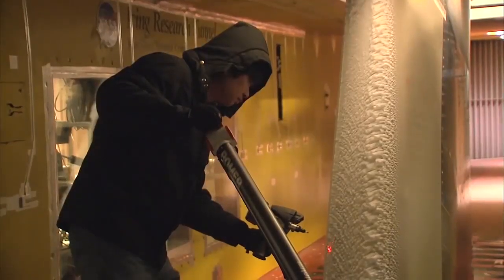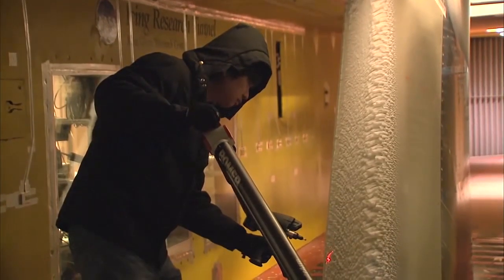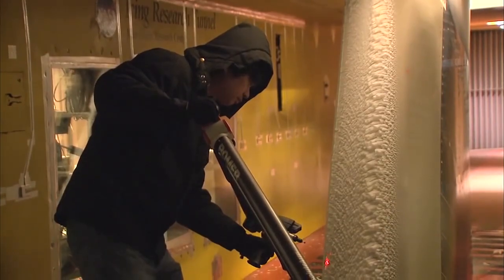Typically in the past, this kind of thing could only be done using a mold and casting technique. One more thing that this scanner lets us do is capture the roughness that forms on the ice shapes. Also, runback ridges and rivulets that are often difficult to capture with tracings can be acquired with this method. So they get a much better capturing of the ice shape.